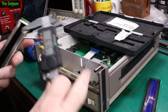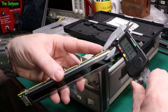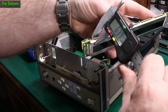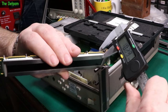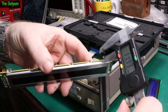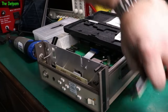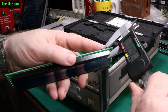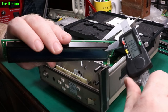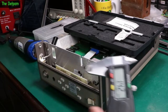I'm going to cut off these posts using a Dremel. I need to work out the depth to cut them to. The original display is 6.6mm there, 6.3mm, 6.4mm — let's call it 6.5mm. The new one is 11.3mm, 11.4mm. So the difference is about 5mm — I'll take 5mm off these posts. I'll make each post 5mm shorter and that should be the right amount.